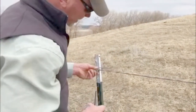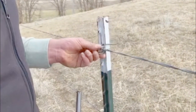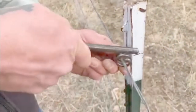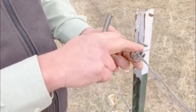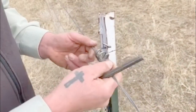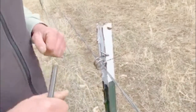The thing you wanna do with a T-post, in case you ever want to interchange, tell everybody, butt that up against the T-post, bring your tool in and bend it up at an angle. What that allows is a gap here. It also gives you plenty of play for if you want to stretch through it for barbs to jump through, if you ever want to disengage and re-engage.